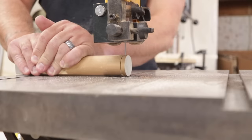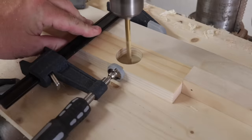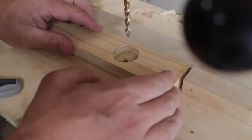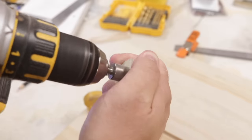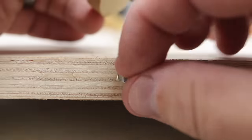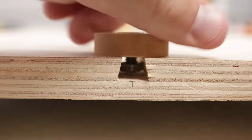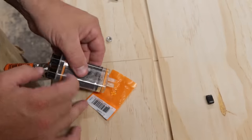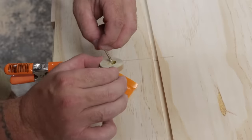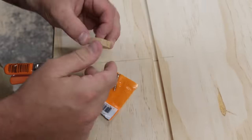The adjustable pivot knob is homemade. I took a piece of dowel and drilled a hole down the center of it — I made a separate short video on how to get a hole perfectly centered in a dowel, linked in the description. That center hole is where I put a screw, which is the clamping mechanism. I set the nut inside the track and screwed it down so the nut pulls up and grips the inside of the dovetail. I used five-minute epoxy to hold the screw into the knob.